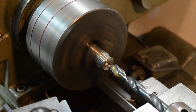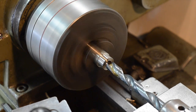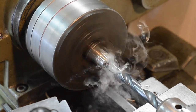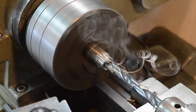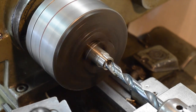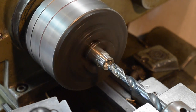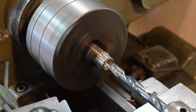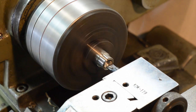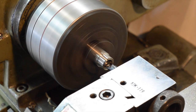And finally half an inch — it's going to make kind of an unpleasant sound, so be warned. Now the hole is wide enough that I can use the boring tool. It's the same kind of cutting tool that I was using on the outside diameter, but it's mounted so that I can use it to remove material from inside the hole.